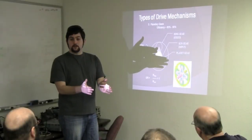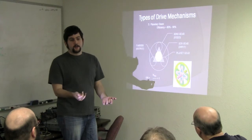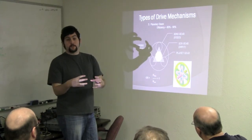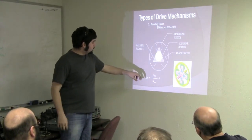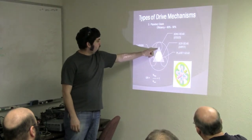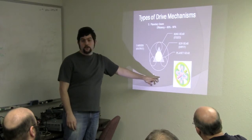Directly couple right to robotic motors, or you go the other side of things and you go buy a drill and whatever motor and you do the work to couple them together. But basically the gear ratio on these for an even set where the sun is the same as the planet is the ring gear divided by the sun gear plus 1.